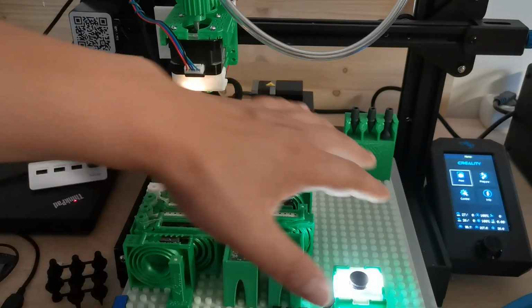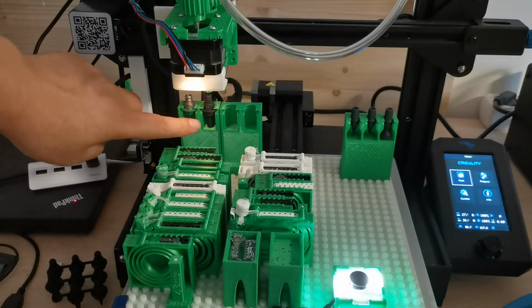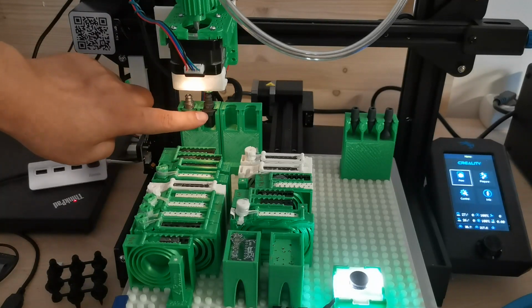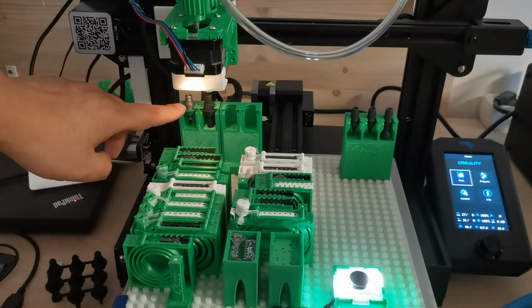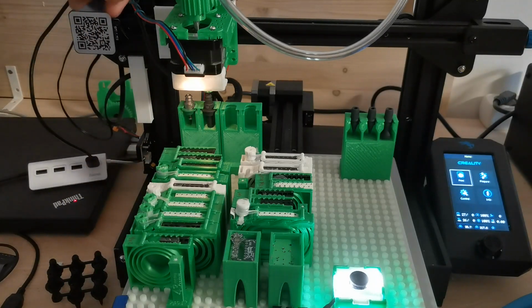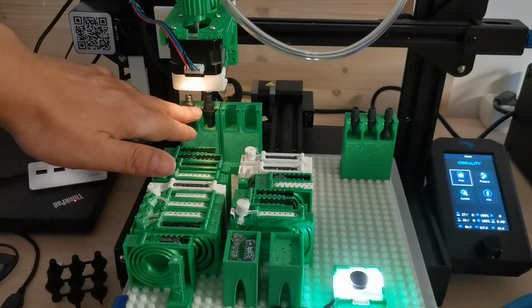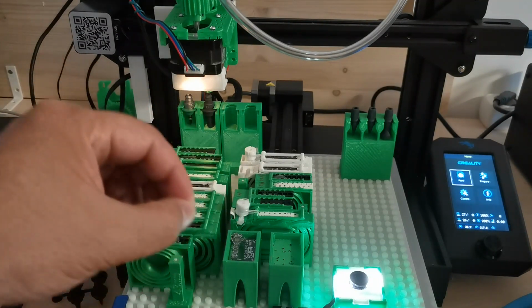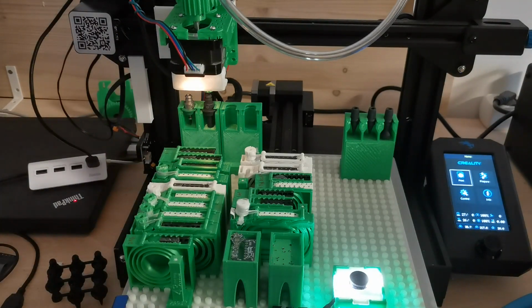So in summary, this time I improved the base plate, which makes it more solid, and I also printed the new nozzle tips, which are compatible with the Juki nozzle tip, and you can see they can use the same nozzle head to load, which is very handy. And overall, I really like the print quality of this, especially this nozzle tip. The small one, for 0201, is also printed well. So, yeah, that's pretty good.